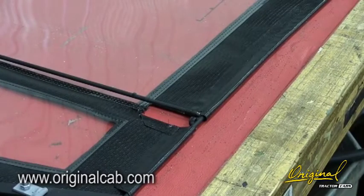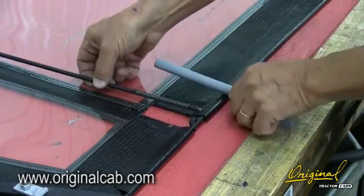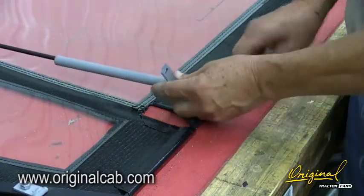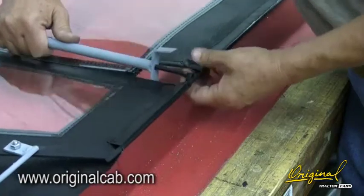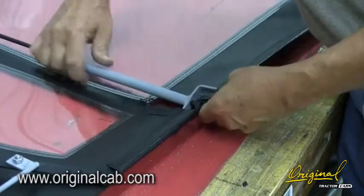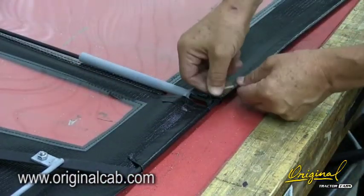Install door latches. This will require the 3/32 Allen wrench. See figure 1. Loosen the set screws in the collar welded to the door and pull the rod out. Slide a spring 2 over the rod to the stop. Slide a door latch 1 onto the rod, reinsert the rod into the collar, tap lightly to seat the rod and then tighten the set screws. Note, the final grip goes to the outside with the hook to the inside.